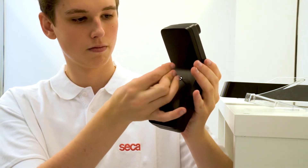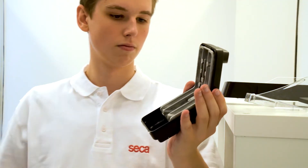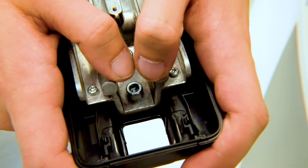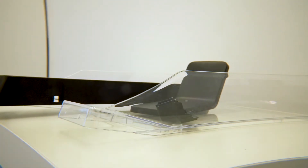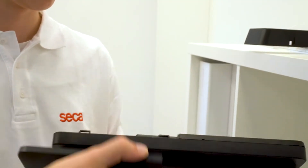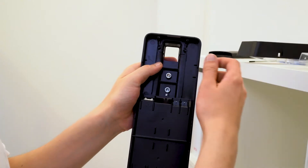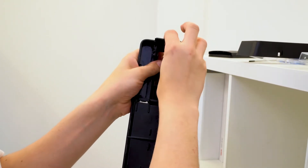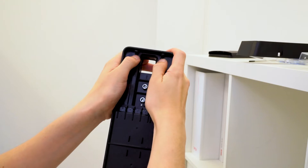Take the handrail connector and remove the rear cover with the 2 mm Allen key. Put aside for later use. Remove the cable entry cover by carefully pushing the two pins outward — this frees the cover for removal. Put aside for later use. Insert a flathead screwdriver into the small slits on the side of the BIA box to remove the two covers. Put the covers aside for later use. Remove the top cable entry cover by carefully pushing the two pins outward, then follow the same procedure for the bottom cover. Put both covers aside for later use.